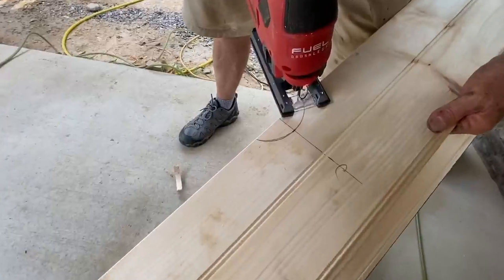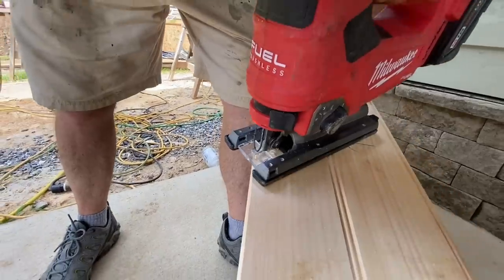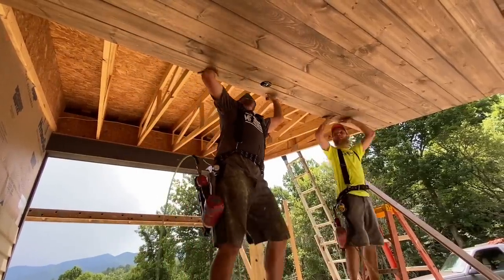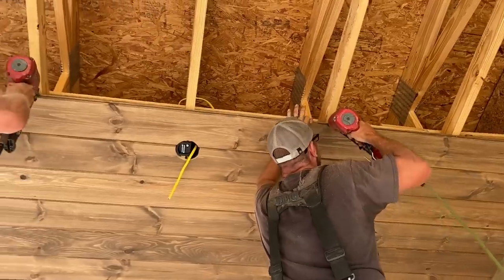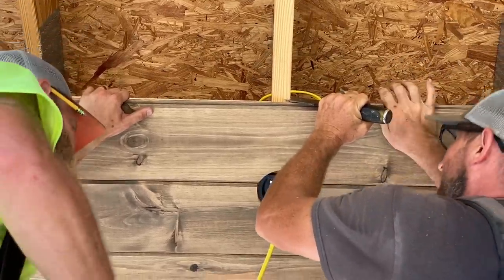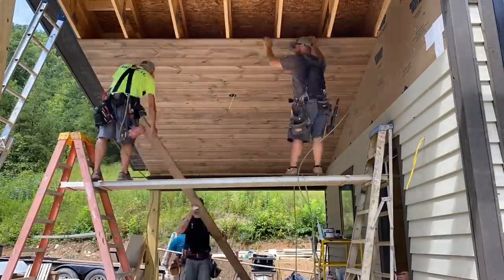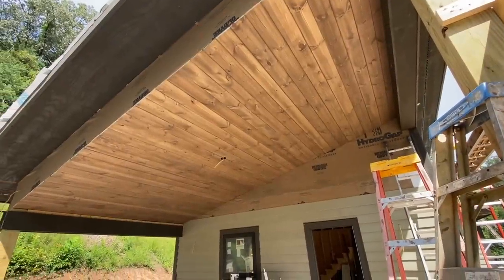A jigsaw is a great tool to have if you're going to do tongue and groove, because you almost always have to cut around can housings or fan boxes on ceilings, and if your cuts are sloppy and loose the trims may not cover the gap. We fasten this material with 15-gauge finish nails through the tongue so the fasteners are hidden. A great trick if you need to pry these boards tight is to use a chisel like a pry bar while someone else nails it, keeping your rows tight and straight. This whole process took about one hour. This is a one-by-eight pine tongue and groove finished with an exterior deck stain.